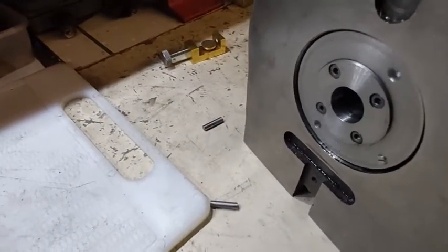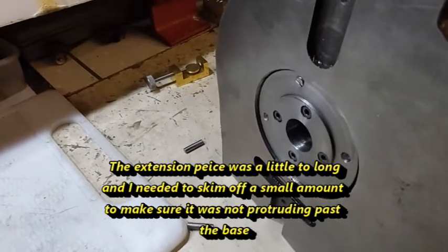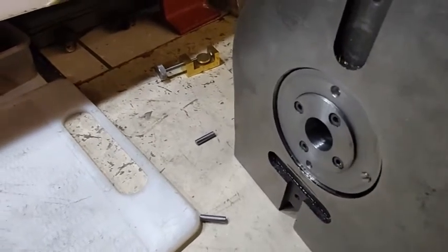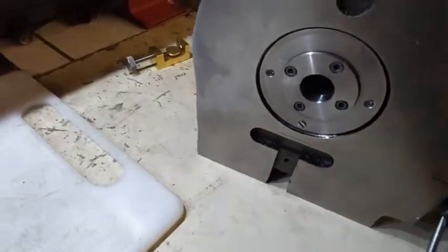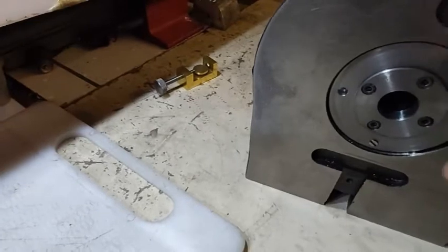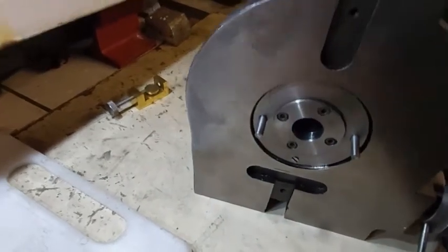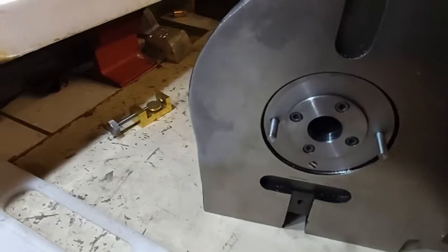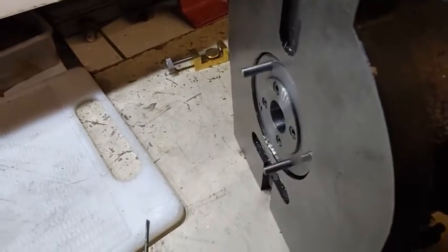It's a lot better and easier to adjust than the four grub screws and four cap heads that were previously used. It worked to an extent but was very fiddly and took ages — this is much better. I didn't even make a spanner; all I've done is drill two five millimeter holes and used two pegs, and that's all it needs. Put two pegs in and you can adjust either way until you get the correct thrust, then just tighten up with the grub screw and it locks in place. Really, really good — 100%, job done.